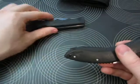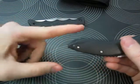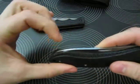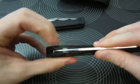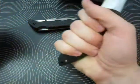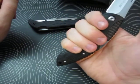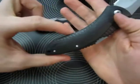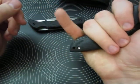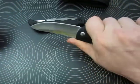This portion right here was a peak. And I just took off the peak, closed up the knife, and slid another blade around that to smoothen it a little bit out, because my hands are too large to fit in that really big choil, if you want to call this a choil, this curve. My pinky was landing right on that peak, and that was very uncomfortable, so I took that off. It is much better now.